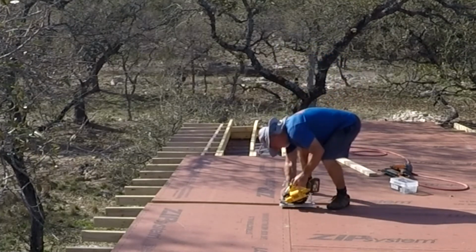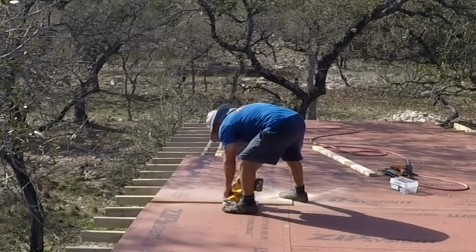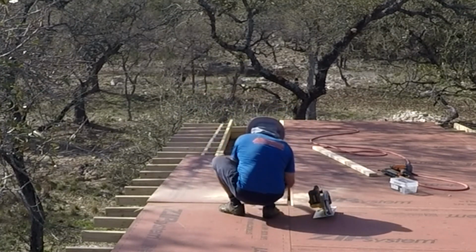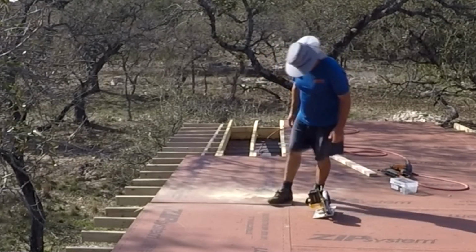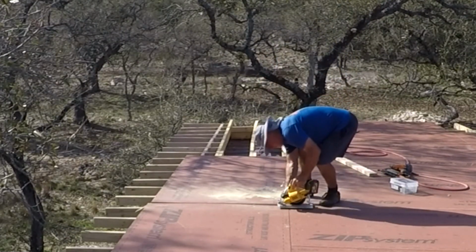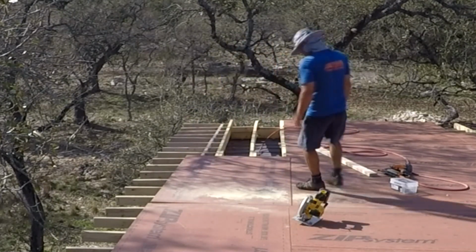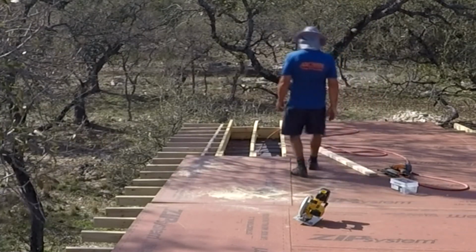So some panels I have to adjust. You can see that the rafters, it's in 4 sections, right? So you can see them kind of misaligning. That's so I can get them on the rafters properly, and nailed to that. Here, this one needed a little bit of persuasion. I set the depth of that saw just deep enough for the panel, and then I trim it off so it'll set properly. The sawdust, by the way, is slippery, so that's something to be aware of when you're up there.